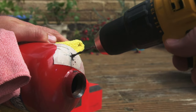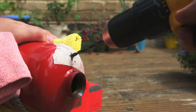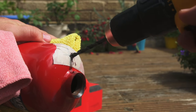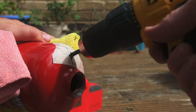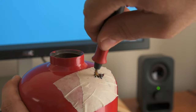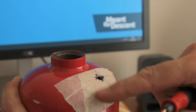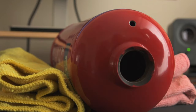Although I need the hole to be 6mm in diameter, I'm starting with a smaller bit and I'll move up to progressively larger bits until the hole's at the right size. I need to remove any burrs from the hole before fitting the valve, otherwise it might not seal properly. I'm using a deburring tool, but I could use a larger drill bit or a countersink to clean the outside, and a piece of sandpaper to clean the inside.